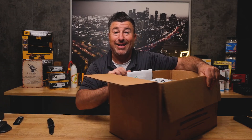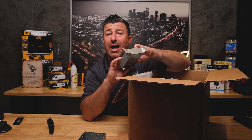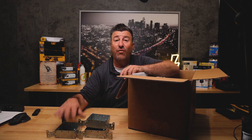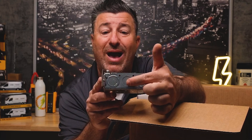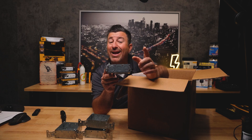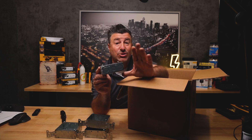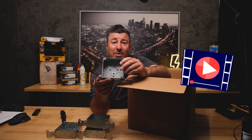Starting off, I got a lot of cool stuff in here. We ordered a bunch of metal boxes, both with brackets and without. I ordered just enough to stock the van — usually six or eight pieces of 4S boxes with brackets. I get the ones with double knockouts up to three-quarters, so half-inch/half-inch or three-quarter. I don't go any bigger than that; those are usually specialty commercial jobs. If you don't know about 4S and 5S boxes, we'll cover that in another video — 4S is technically four inches across, 5S is five inches across.